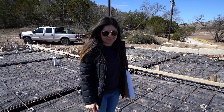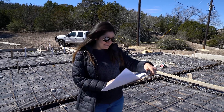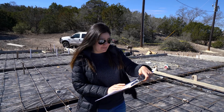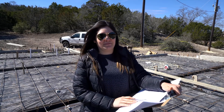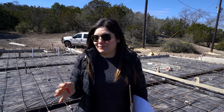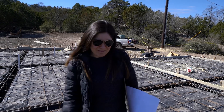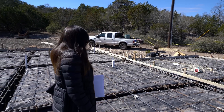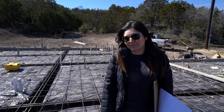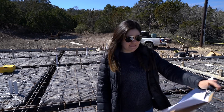What is a pre-pour inspection? Why are you here today? So it's to check and verify everything's done according to our plan — all the dimensions, everything here, we have to make sure it's all the same. Our steel, the pads, those are the most important. Making sure the steel's right. So you make sure we have the proper beam spacing, the beam dimensions, rebar dimensions, concrete thickness. Pretty much you have to make sure we did exactly as you guys told us to do. Because if you design a foundation and we don't follow the design, what was the point?